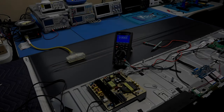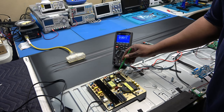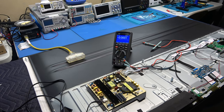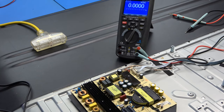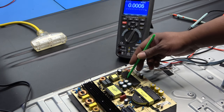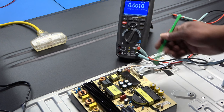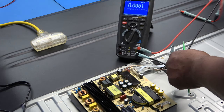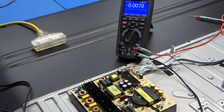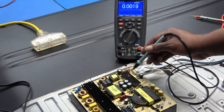The main thing is to just check and make sure that we have voltage going across the LED strips. I'm getting an idea of how the circuit is working so I can trace back. Hopefully what's wrong is we're not getting any voltage there, or maybe the voltage is too low.